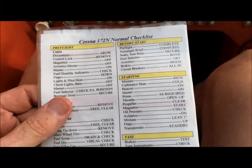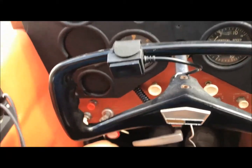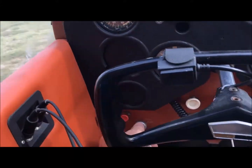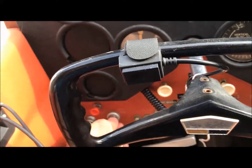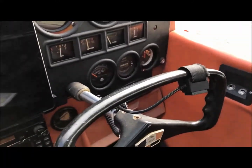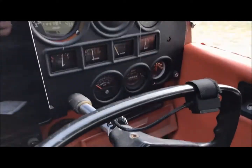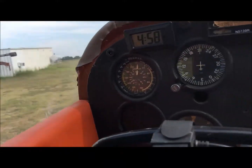Here I try to turn it on and nothing happens, so I pull the master out and start. It starts on the third or fourth blade every time. Quick check: oil pressure is up, temperature's not up yet, oil pressure's up, I have vacuum, and I have a positive charge on the generator — so everything is looking good at this point.